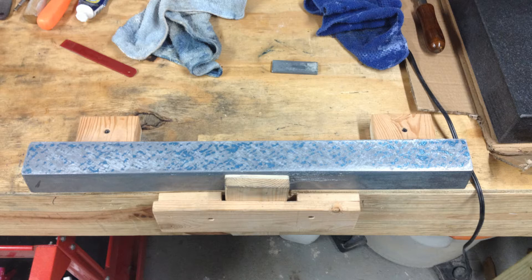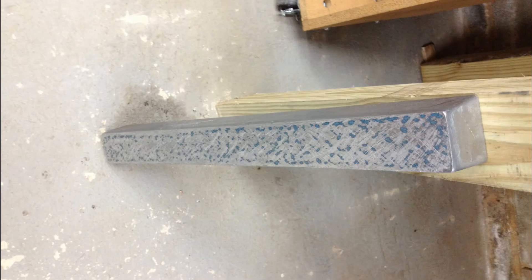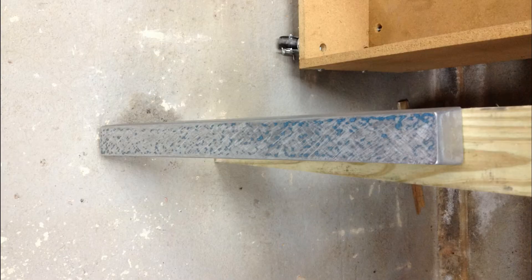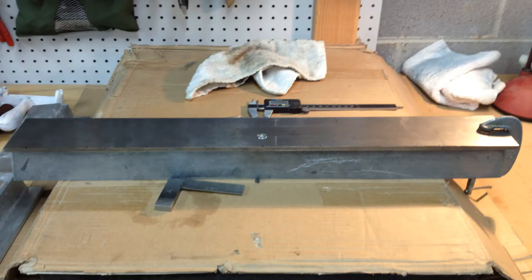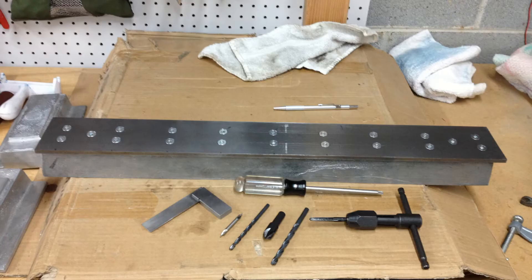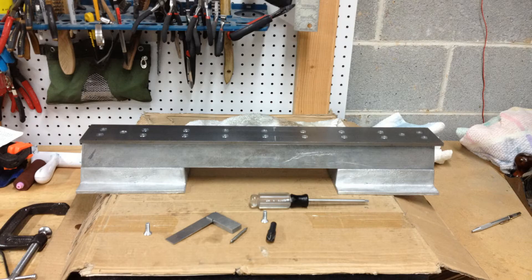This is after a few rounds of scraping on the surface plate. Here are a couple of iterations on the surface plate. This is what it looked like before I decided to join the bedways to the bed. This is clamped up and after I've drilled the first quarter-inch hole. Then I countersunk and installed a fastener, tapped the hole in the lathe bed, and repeated that process for a number of fasteners. Then I put on the feet.